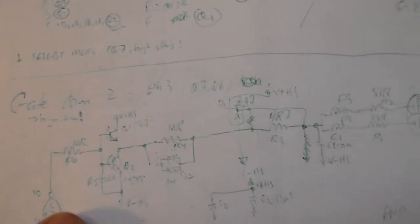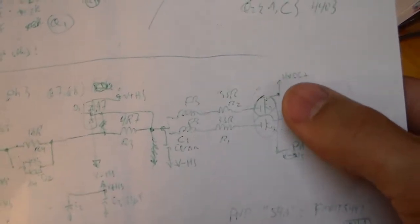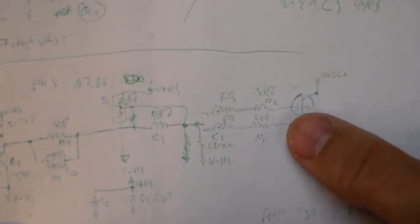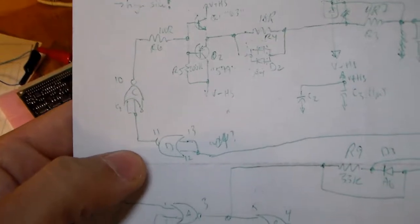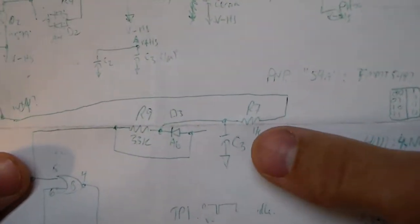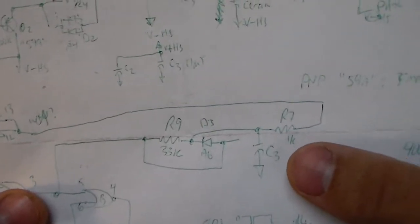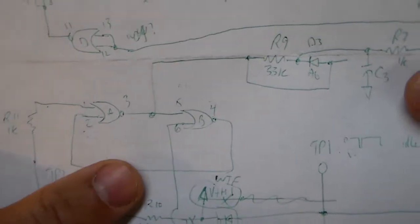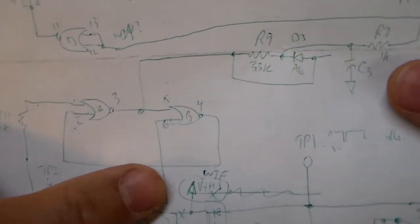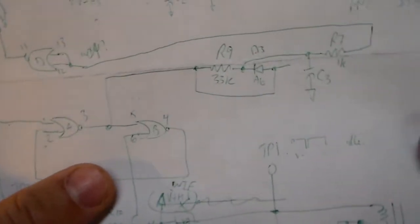This is part of the high side drive schematic that I drew. Starting with the IGBTs — on this model they're single, but another one I worked on had two transistors per phase. The gate is driven through all the circuitry by a push-pull stage and two inverters. There's a time constant arrangement that looks like it only drives the gate by pulses due to the feedback, with something here that stretches the pulse. I'm working from memory and have nothing to support my claims — this is just what I think I observed on previous boards.